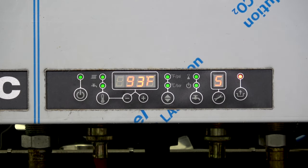We accept that and go to option 7 — the summer shutdown temperature. In this case it's set at 70 degrees, so when the outdoor temperature sensor senses 70 degrees outside, this boiler will stop firing for space heating. If we have a tankless system or an indirect hot water heater, it will fire to heat up the indirect hot water heater, but no space heating call will be answered.